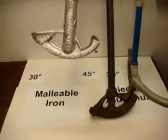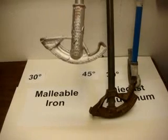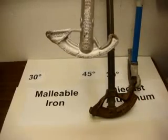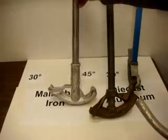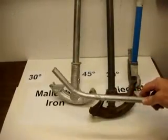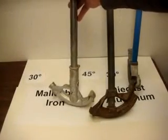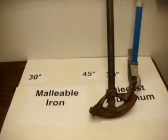You cannot tell when you are dealing with a 10 degree, 15 degree, 30 degree bend. It again marks where you can bend your 90 degree, and when this handle is vertical, you have an exact 45 degree bend. I do not use these benders. There are still plenty of them around. Many of them are for sale on auction sites, but they are very difficult to use and make accurate bends.